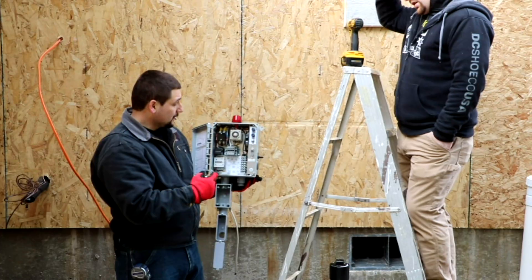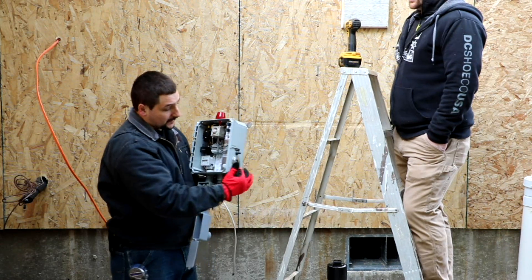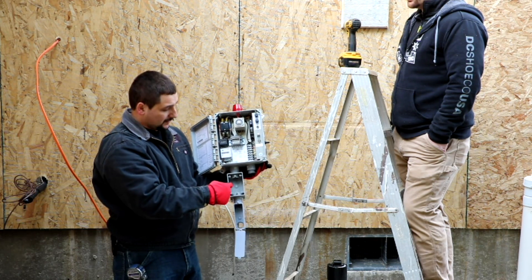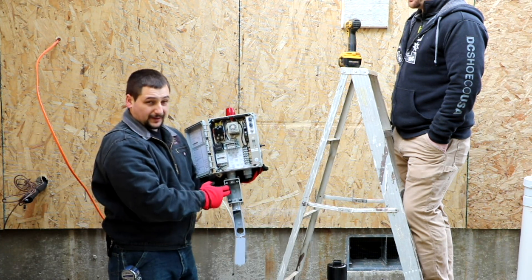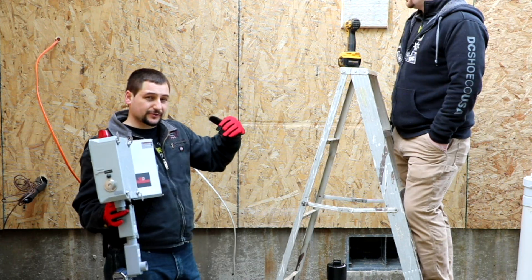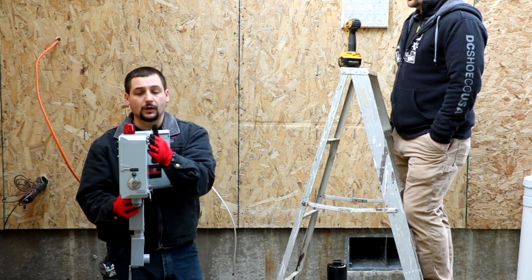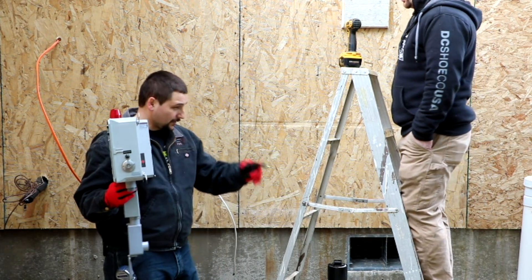It has the hour meter showing how many hours the pump has run — more troubleshooting stuff. It has internal breakers built into it, extra fuses, the alarm and the visual alarm, and the silent button if there's an alarm problem on the side. There's a power switch which is basically just an on/off switch for the main power for the unit, and the wire will come out of the wall and go up into the panel. We've attached a trim board to the outside of the house so that when the siders come they have something to side up against. Then we'll get some conduit put in and start running the conduit over to the tank.